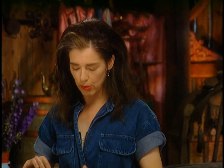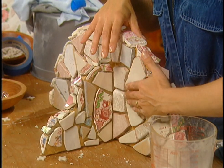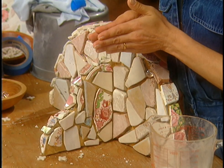There are two kinds of grout. Sanded grout has sand in it so it fills bigger spaces. Unsanded grout is powdery and very fine — it flows into tiny spaces. You can use the powdery stuff, but I've got big spaces.